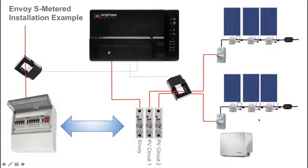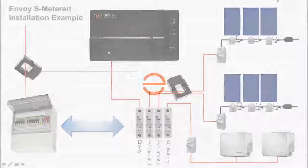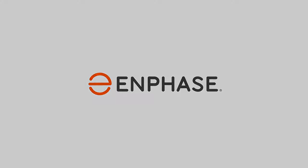The final step for your complete home energy system is the AC battery installation. The Enphase AC batteries are installed again to an AC circuit with an isolator running back to the switchboard on a dedicated 20 amp circuit breaker for the AC battery main switch. And that is a complete wiring example of the Envoy S Metered for a single phase AC battery installation.